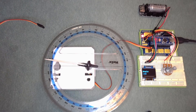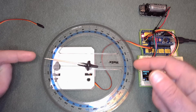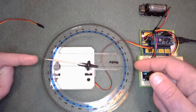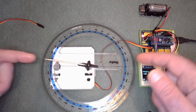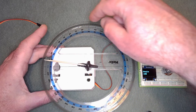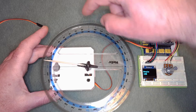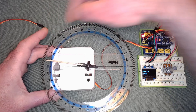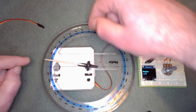So the actual range is not 180 degrees — it's 4 to 172, only 168 degrees. There's also a slight asymmetry: the center comes out at 94 degrees rather than 90, so 4 to 94 is 90 degrees squeezed into 86 degrees on one side, and the remainder up to 172 on the other. A different amount of sweep on each side — typical of these slightly cheaper servos.